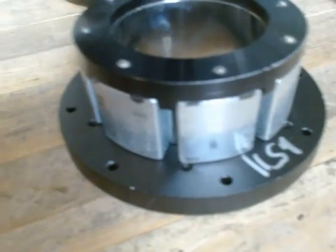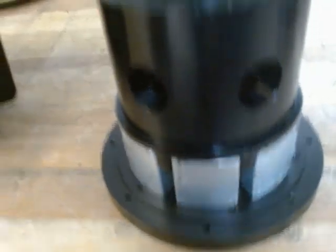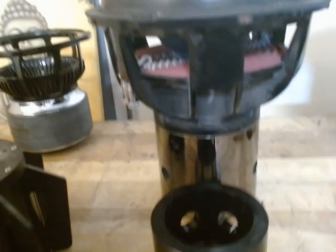The gap is a little bigger for an eight-layer coil. There's also a little ridge here for better self-centering than the V4, just to make sure — that's one of the advantages of these over other radials. Basically these can't be put together if anything's wrong.